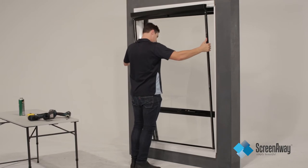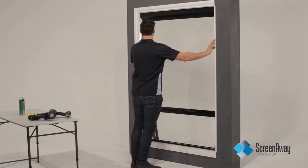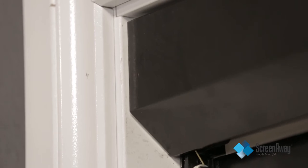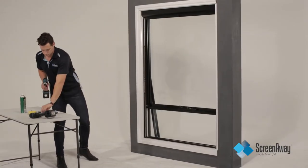Place the frame inside the reveal. It is advised where possible to fix the top cap of the blind inside the edge of the reveal. If any obstructions, such as locks, keys and certain window components stop this, it may mean the top cap may sit slightly proud of the reveal.